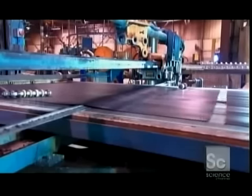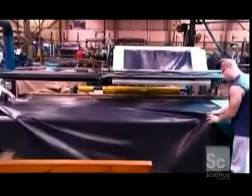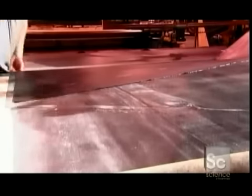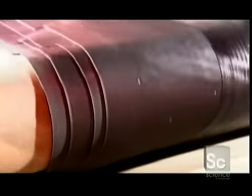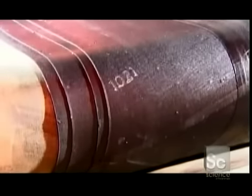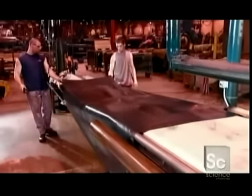They make the tire's basic structure from rubber-coated nylon cord. They cut the nylon rubber ply to a specific length, then piece several of these sheets together to form a loop. The pieces adhere because uncured rubber is naturally tacky, and a machine rolls the loop to the correct size. They layer more nylon rubber ply in a criss-cross fashion to add strength. The machine applies a thin layer of ordinary rubber between each criss-crossed layer, thickening the rubber loop. The finished loop is called the band — it's the skeleton of the giant tire. They hoist it onto a cart and move it to the next station.